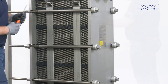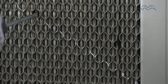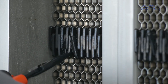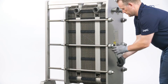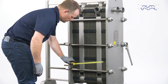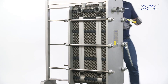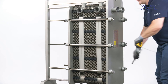While tightening the bolts, check that all gaskets are securely fitted in the gasket groove. If any gaskets are protruding, press them firmly back into the gasket groove using a pointy but blunt instrument. Be sure to also check that all gasket clips are positioned correctly and securely in place. While tightening the four tightening bolts, be sure to also tighten the locking bolts. Continue tightening until the A measurement has been reached. Do not over-tighten the heat exchanger. The maximum amount that the unit may be tightened is equal to the A measurement minus 0.5% of the total. Over-tightening will lead to plate damage and crushing of the gaskets.